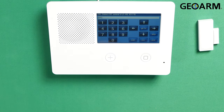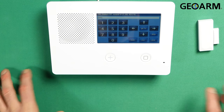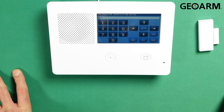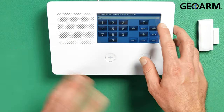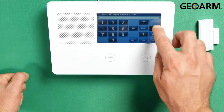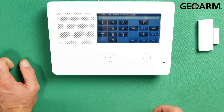Once you hit System Configuration, the first available zone — or zone one actually — is gonna appear on the screen. That's my first available zone, but for the sake of this video, I'm just gonna go ahead and move it to zone three. You just hit the right arrow to change what zone number you want to program on. In this case, it is zone three.